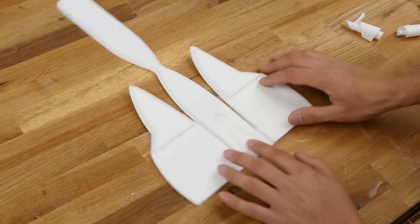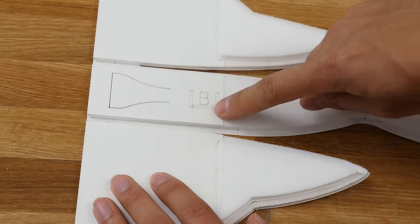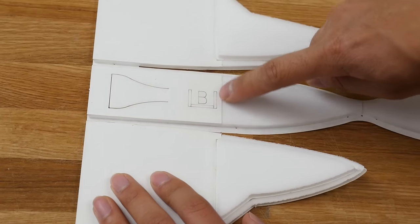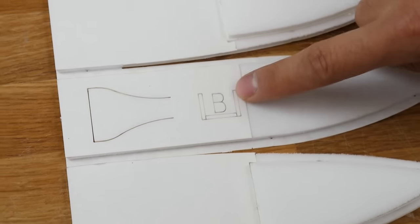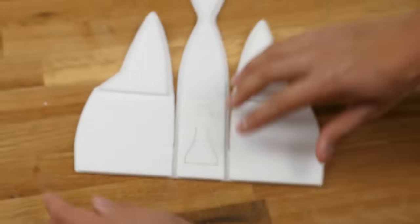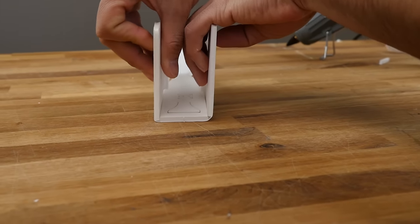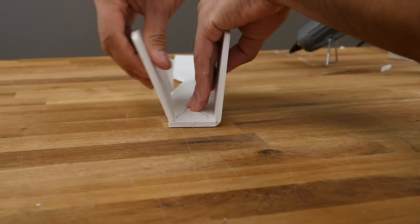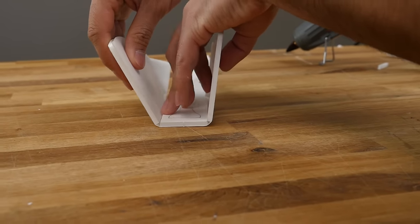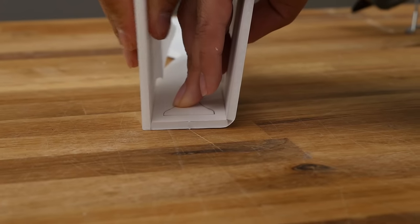Once this is cooled, it's time to move on to our B-fold. If you're not familiar with the B-fold, B is for 'beside' — you can see the diagram here showing the side plate, side plate, and bottom plate as seen from behind, so it folds up like that. This is incorrect — this is an A-fold, which is 'above.' You can see how this plate goes above. That's wrong for this step. You want the B-fold, which folds down.